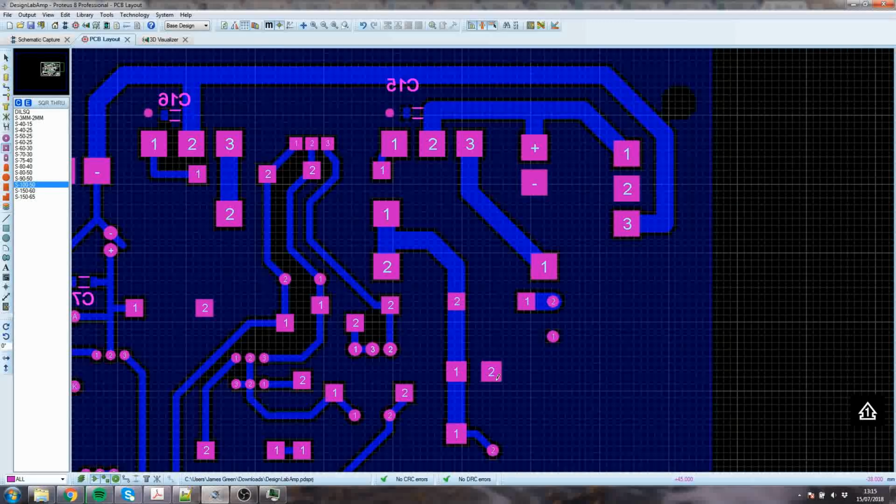So it's easy for the currents to return from pin 2 to this pin 2. There's plenty of copper here, not much in the way really. We don't expect there to be a voltage drop between these two, because there's some copper, there will be a resistance or resistivity, and there is a thickness of the copper on the board, and so on and so forth. It could be a little voltage drop, and it's very undesirable.